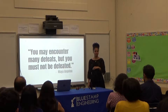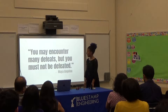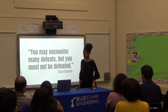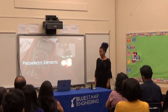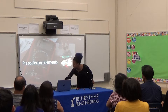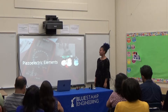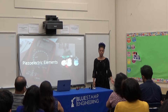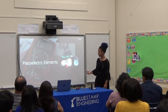I actually had three projects. Two of them did not work, so I'm going to go through all of them today. My first project was battery charging shoes. The first way I generated energy was with piezoelectric elements. Basically, piezoelectric elements are crystals, and when applied pressure, they output a voltage. Sadly, the piezoelectric elements did not produce enough current to actually charge a battery sufficiently, but I was able to light an LED or some other type of light.